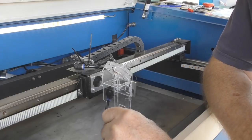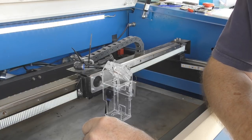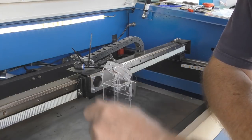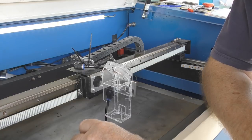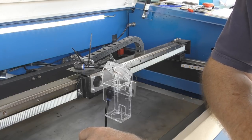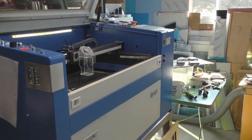The only thing we've got to do now — the easy bit — is to move the head backwards and forwards. Let's just make sure the circle is completely round. We can go up just a little bit more — with this system we can get it absolutely spot on, we haven't got to spend ages fiddling around with the position of the tube. Ten minutes and we've got the machine perfectly set up in Z. You'll note that I've put the copper mirrors back into this machine. Here we are two years down the road after I made these mirrors and they're still working perfectly.